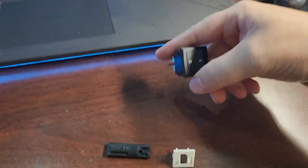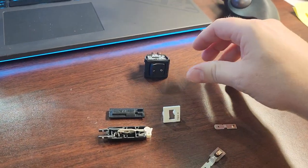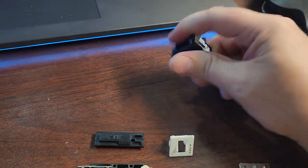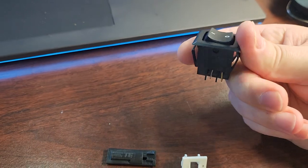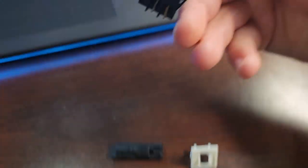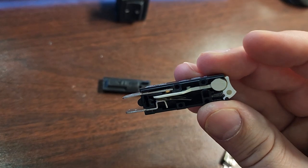You're also going to find these devices in places you probably don't realize — in a three-position breaker power switch. I've seen these on Pantero microscopes and a few other places. It'll be like a three-position switch and you can always feel the difference — it has that very sluggish ka-chunk ka-chunk action when you are actually tripping the breaker. When you're on and the breaker trips, it's going to be in a middle section. To reset it, you have to allow it time to cool down, then press it to the off position and back to the on position — that's the equivalent of resetting the breaker, allowing those points to come back together.